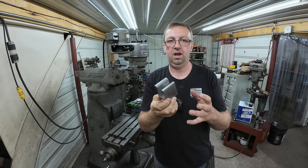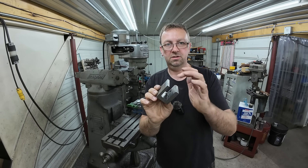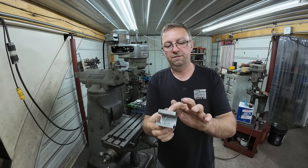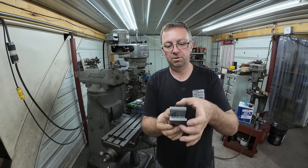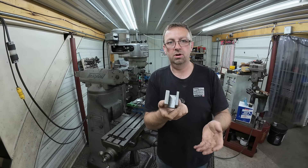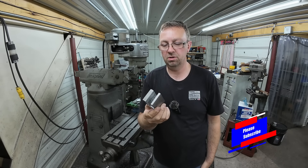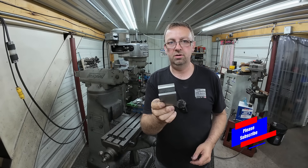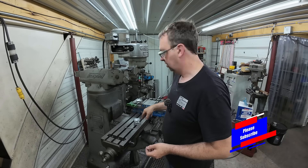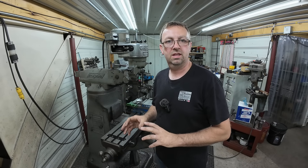I make these up — I had a whole bar made up to all the specs of the groove and everything, and then I cut them off to length and finish drilling them. There's one hole that goes through for a bolt to lock this in, and then we tumble them to deburr because there's a lot of angles here and it's a lot of work to deburr these. So I'm going to go ahead and drill the hole we need in each one, then fill the tumbler with media and get that ready.